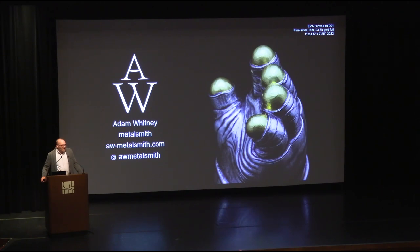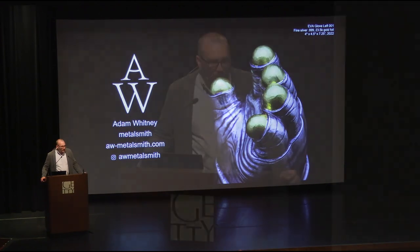I think it's really difficult, especially with pieces so old. Even if you can't see a crack when I finish it, there may be work that already has a crack in it that will reveal itself in 20 years, in 100 years — who knows what will happen in 1,000 years and whatever condition it's in. If it's in a corrosive atmosphere, that corrosive atmosphere is going to find that crack first and start eating away in there before anywhere else, making it more emphasized.